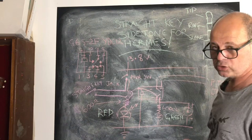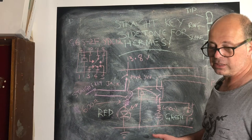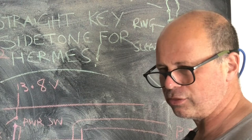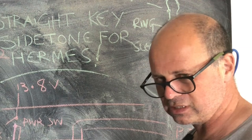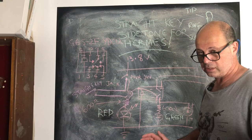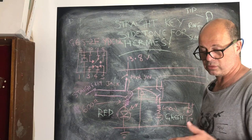And I've also set one of the parameters so that you minimize the key jittering. So we don't have full break-in QSK or whatever keying, but I don't like that. I like the thing to be transmitting or receiving, care of all the simple transmitters and receivers that I've been using homebrew. So you have seen me demonstrate this system through an online SDR, and also using this sleeve to tip configuration when I did the QSO in the video. So it works for me.